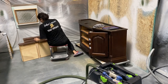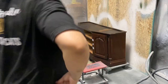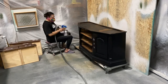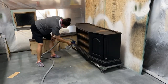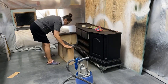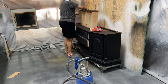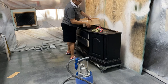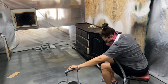I am on the bottom making sure that I fill all of the holes that need to be filled. On the drawers we're going to be okay, but I am still filling all of those little ghost marks that some of the old hardware is leaving. On the doors I am actually filling the entire thing because I will be drilling new holes. I am using my preferred black primer, which is Aqua Lock. I love using black primer when I am going to be painting a piece in black because it just makes it so much easier — there is less actual paint needed; in most cases only two coats is necessary. When I am doing the drawers, I always prefer to tape the insides so that there is no overspray.